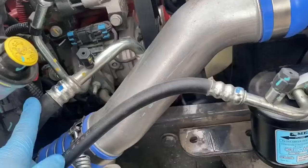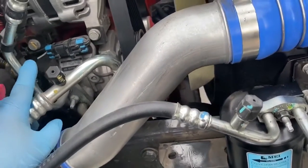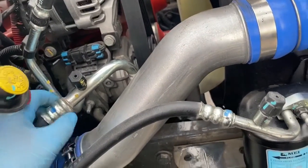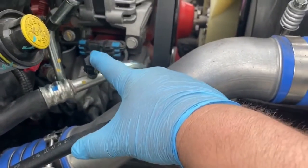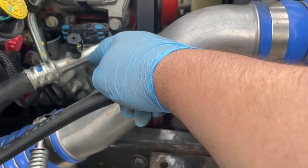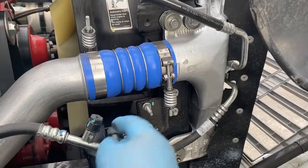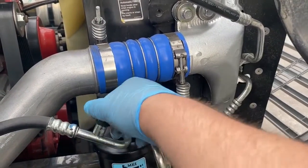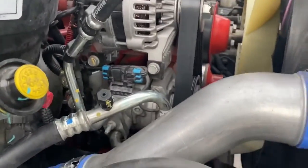How do you check the difference between the low side and high side lines? The fatter line is the low side; the smaller line is the high side. And these are your service ports. As you can see, that's the low side service port — the line's bigger, fatter. And this is the high side, because it goes around the high side; it's still the high side because it's a smaller line. This is the high side service valve. That's how you tell the difference between the service valve connections for high side and low side.